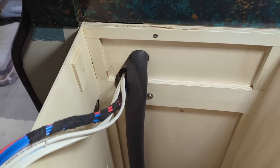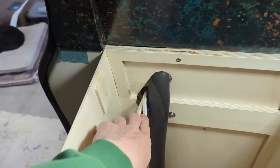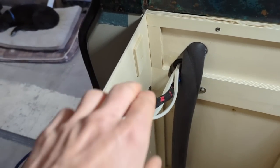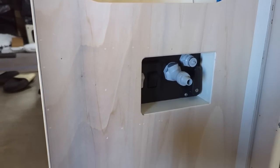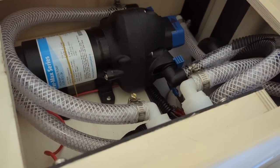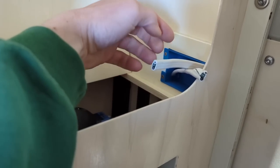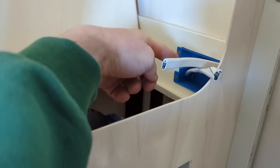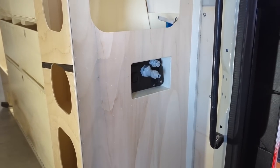One of the things I like to do ahead of time is get everything small drilled out that I need. Here I needed to pass this hose up my wall to come up to my faucet, and also get this hole drilled so I can get these wires run out. Then I've got these little reinforcement plates because I need some T-nuts here to secure another cabinet to it. On the back side of the cabinet I had pre-made this little panel with plumbing parts and electrical switches, so I could just plug in all the plumbing. A lot of this — like cutting the hole for the electrical outlet — I think a lot of people do once it's installed. But on the bench I can rotate the cabinet and cut in the easiest manner possible. It's just a lot easier to get all those details done, even though it's more exciting to just bolt the cabinet in.